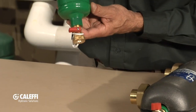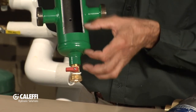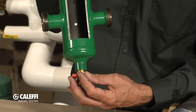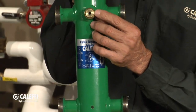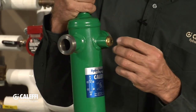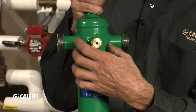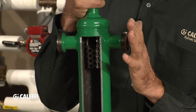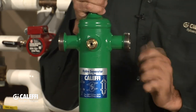On the bottom end here, we give you a ball valve with a hose connection so you can flush any dirt and debris. You can see how we've extended the bottom barrel a little bit — any dirt, debris, or weld slag left in the system is going to settle to the bottom, and then you can blow it out. One last thing we give you is this port that's been drilled for a display unit — it's a temperature port. We've got a temperature well that screws in there as a dry well, so you can stick a sensor in. A lot of installers like to trigger their boiler or chiller from a sensor going right into that water, because it's a good central sampling point for what's going on in your system.